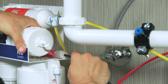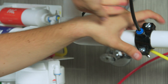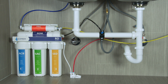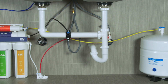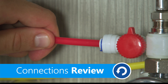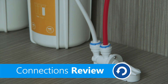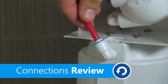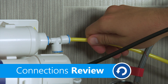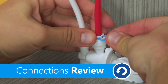Connect the black tubing to the flow restrictor, then connect the black tubing to the drain saddle. Connect the blue tubing from the RO faucet to the PAC filter. Make sure all connections from earlier in the video are complete and secure before moving on. Use red tubing to connect the feed water adapter to the in part of the leak stop valve. Use white tubing to connect the out part of the leak stop valve to the sediment filter. Connect the red tubing from the automatic shutoff valve to the ACB filter. Use yellow tubing to connect the PAC filter to the tank valve. Make sure all connections are secured with a locking clip.